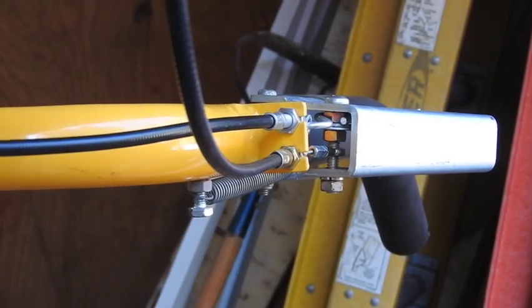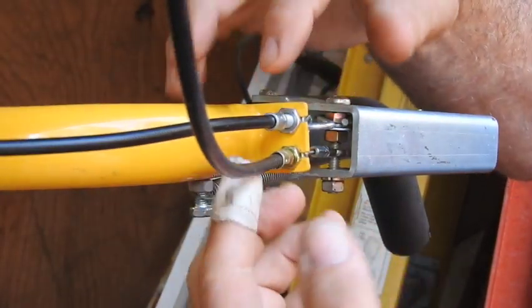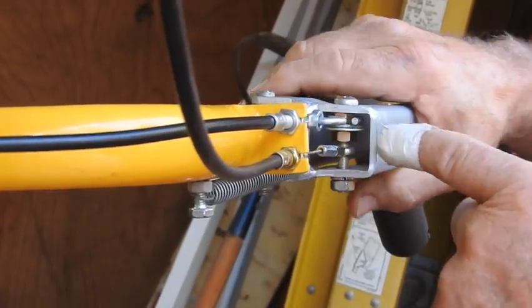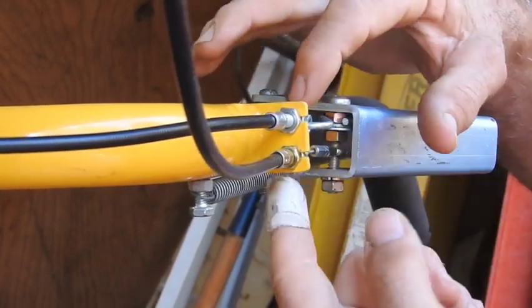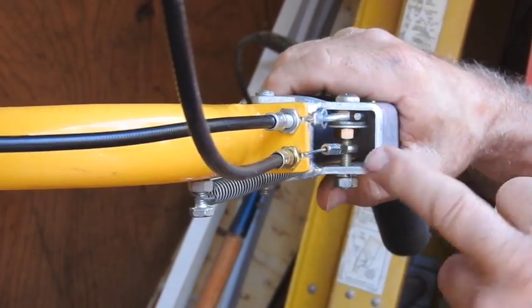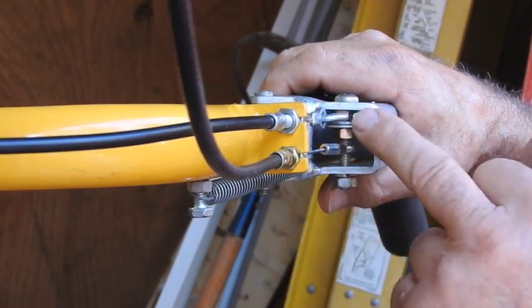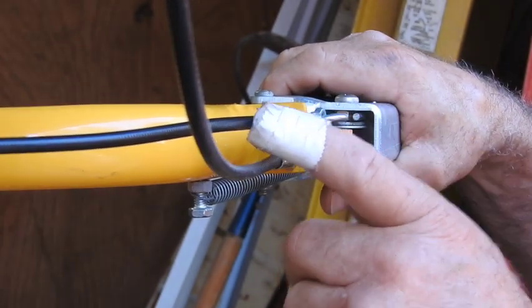A simple change that I made: the way they have this rigged up for the water trigger as well as the throttle connection into your throttle lever right here was not satisfactory to me. I can't remember exactly what it was, but I think both of them had to hook on a single point. I didn't like that, so I had to re-drill and put in a quarter inch bolt, and then re-drill the openings where they fit the quarter inch, and then made the two separate so they pull directly right out of the sheath.